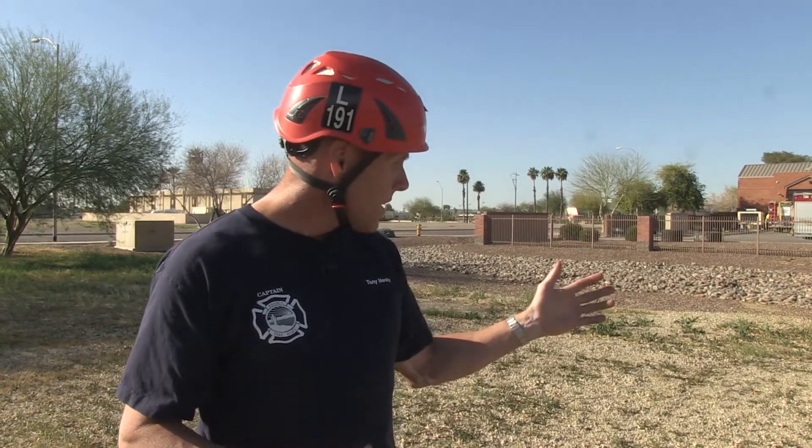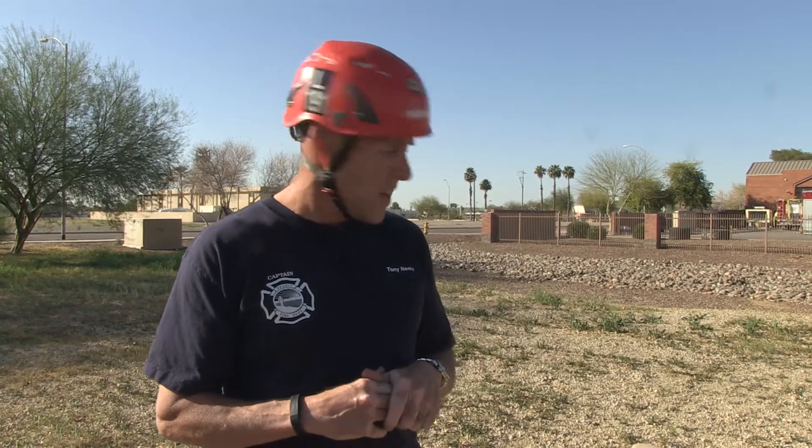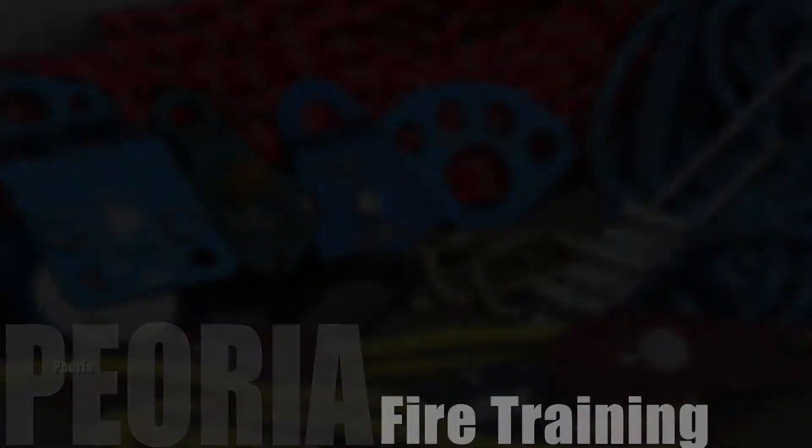And there you have it. The strength of the system is going to depend on the type of soil you're in. Class A soil with high clay content makes for the strongest system; you won't get as much force applied in Type C sandy or pre-disturbed soil. Today we've set this up in soil with pretty good clay content that is previously disturbed — we're behind an old fire station that's been graded, so maybe class B soil, not the strongest but not the weakest. In our next video, we're going to put a load cell on there and show you the amount of force this system can take in about class B soil.